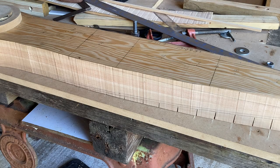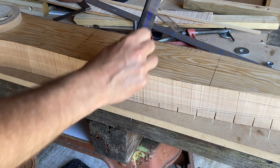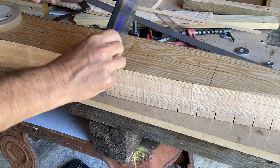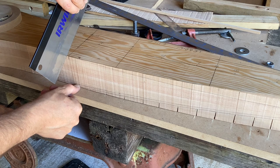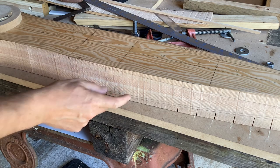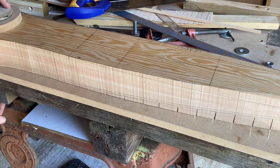Funny the things you only notice when you actually start doing a job — you can think about it for hours and then practical issues arise. I need to cut down the other way, doing it at the bench on the other side. But looking at it, I've got to cut right down to that line and there's no way I can do that easily at this height. So I'm going to make a couple of packing pieces to go under the blade and extend the studding — fortunately it's quite a bit longer underneath — and I'll find some MDF and use that as packing.